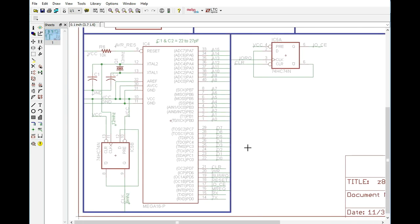Because we are going to be using this to take control of the bus, and we also would like to have some I/O, for example an SD card, we need to free up pins 5, 6, 7, and 8, which means that we're not going to be able to use this as the lower port of the address bus. Instead, we can use port A as the lower address pins, and then use one of these pins over here, probably pin 4, as a latch, so that we can latch the high address bits and then write the low address bits during any type of DMA cycle.